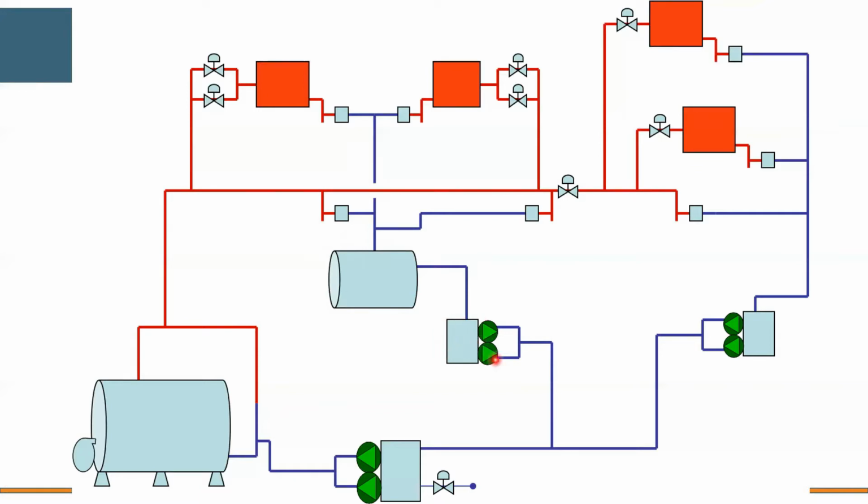When this fills up, the pumps come on, one or two of them, and transfer that condensate back to what we call a boiler feed or a deaerator. This simply holds water for the boiler until the boiler requires more water as it's steaming, okay? We're gonna take that 100-pound steam and we're gonna continue it through our system.